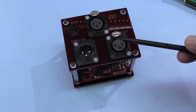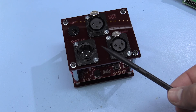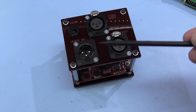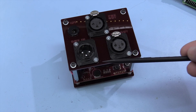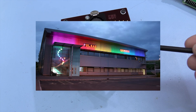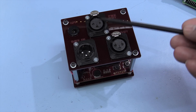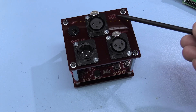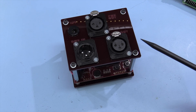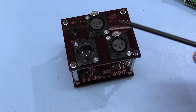When these lights were designed in the early 90s there wasn't really a standard protocol — DMX is a little bit newer. The company that designed the electronics for Clay Paky is an English company called Pulsar Light of Cambridge. They designed lighting desks and came up with their own command-based protocol called the PMX interface, used mainly on their own desks such as the Pulsar Masterpiece.